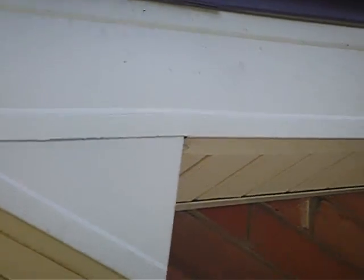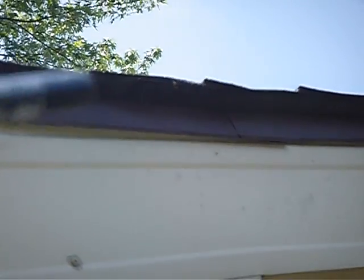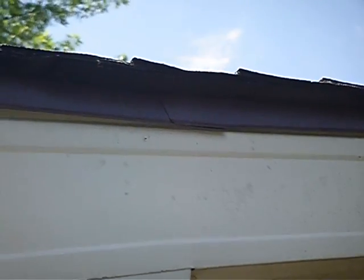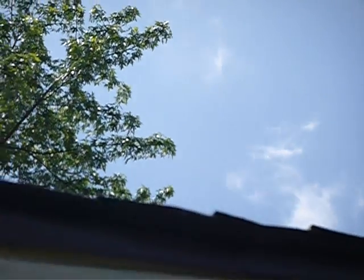This is called a cornice, this is called a fascia, and between the shingles and the fascia that little brown metal strip is called edge flashing — in this case it's the rake edge flashing. See how it's lapped right there? The manufacturer says it shouldn't be lapped any less than ten inches. You'll probably never have an issue with that — it's going to be on just about every house you look at — but the manufacturer has different specifications, so it's going to make the report. This siding is still too tight — it still wasn't hung right.